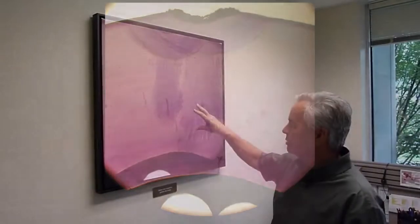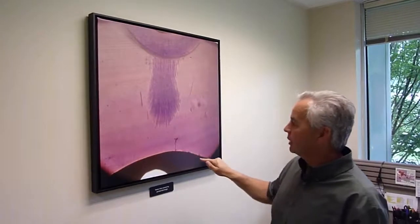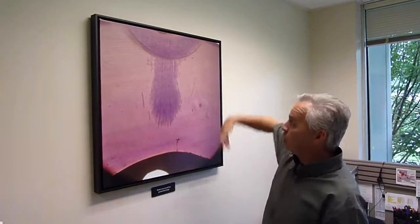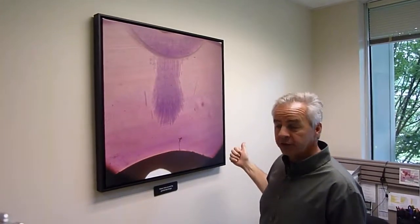So the water tree is the fundamental cause of insulation degradation in polymers, but the electrical tree is what happens just before it fails. So this cable failed 5 inches away from here, and it blew a hole through like the ones that we've seen. But this started to fail here too, but the other one failed faster.